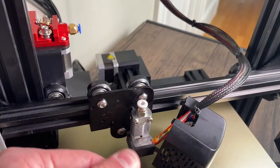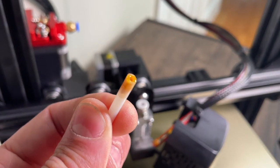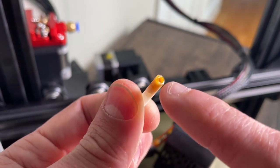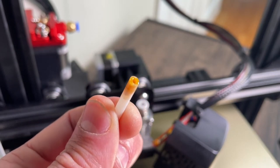In the previous step I actually needed a second set of hands, and you can see the reason why here. There's actually filament that clogged the end of the Bowden tube, and the Bowden tube is melted a little bit — and that was actually causing the Bowden tube to get stuck in the fitting.